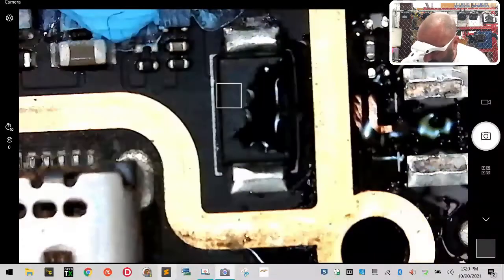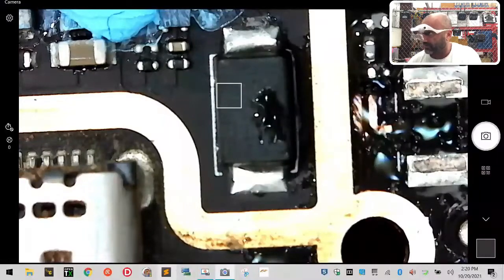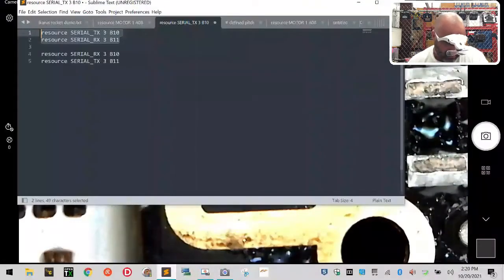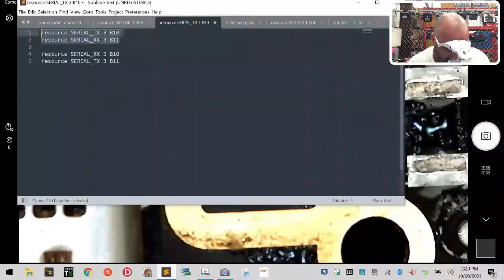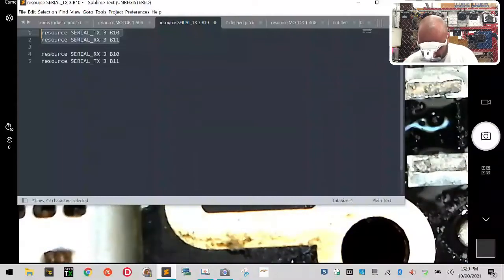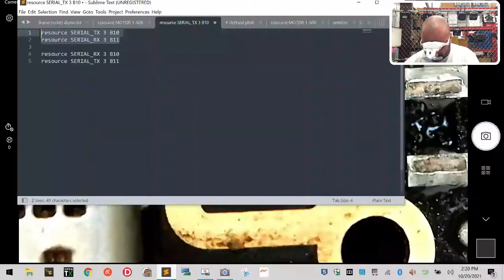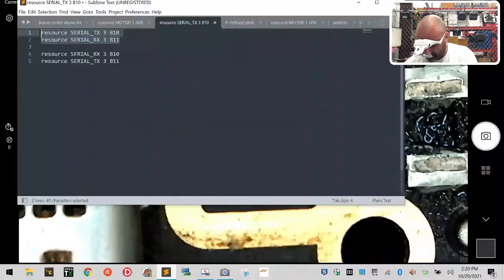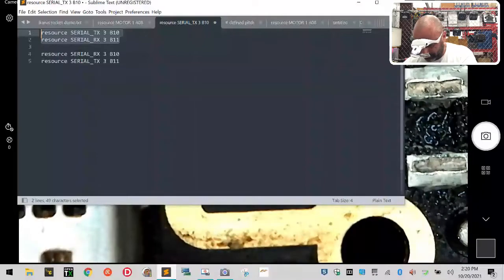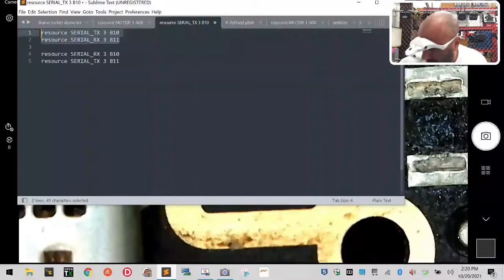You have to be able to solder, and this is where it gets really interesting. You're going to need a very, very fine tip, so I'm going to change my solder tip. It's kind of like if you were to poke it into your skin, you'd bleed pretty quickly. That's how sharp and fine you want it, and I'll show you the one in a second, except I've got to clean it first because this has not been cleaned yet. One second. Let me turn that on, and I'll show you what I'm working with here.